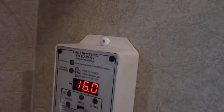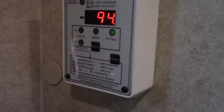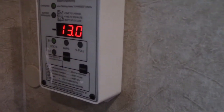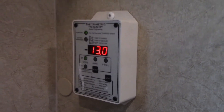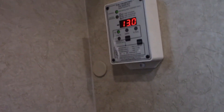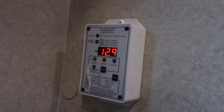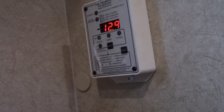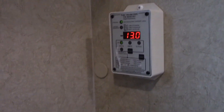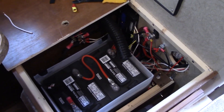You can also select the percentage view on the Trimetric — we're at 94% right now — and monitor voltage as well. To wrap this up: this solar kit had been sitting in the garage for a couple of years. You can obviously get a much better MPPT-style charge controller and better panels, but 200 watts of solar with a couple of 6-volt golf cart batteries is a pretty good combination, and a PWM charge controller is more than adequate for that. Combined with the Trimetric battery monitor and its shunt, you can monitor the solar setup quite well. If you have any questions, leave a comment below.